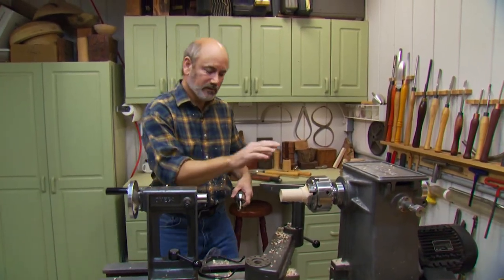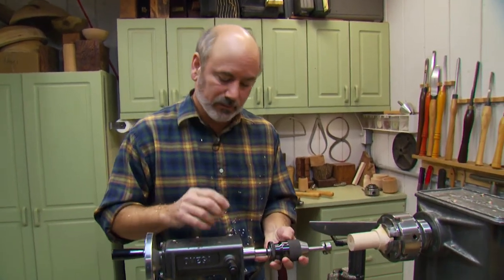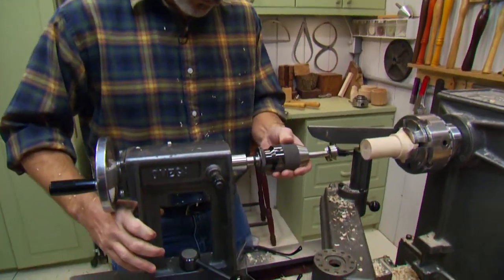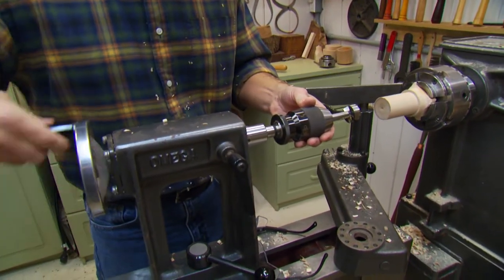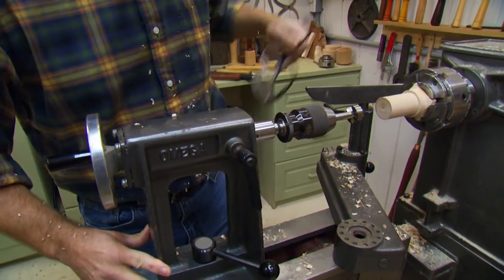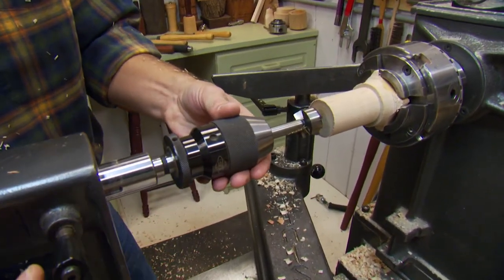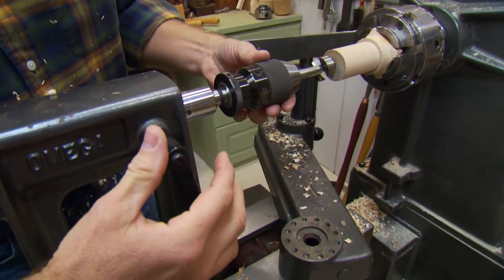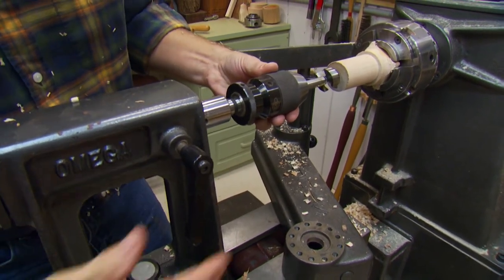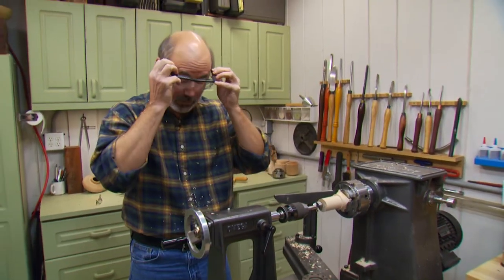Okay, well, I've got the blank rounded out now to 1 5/8 of an inch in diameter. Now, I'm taking my Jacob's chuck, and one good technique with this, take it and go whack. Oops, I'm gonna do that again, get a little more tailstock out here. There you go. Put it in firmly, because one of the problems when you bring up a Jacob's chuck is it wants to wobble and move. Well, if you take your tailstock, and just slightly tighten that and then back it off a bit, it'll take out some of that wiggle. So when you go in, you drill a straight hole. You don't have to worry about it going a little bit off center.